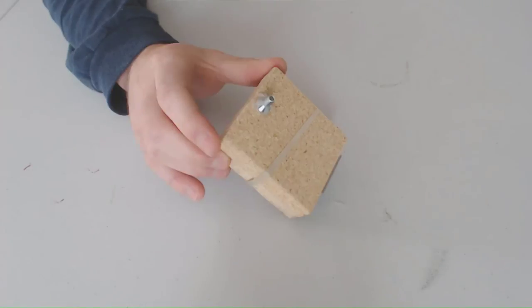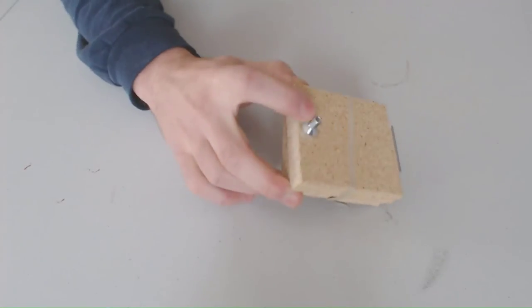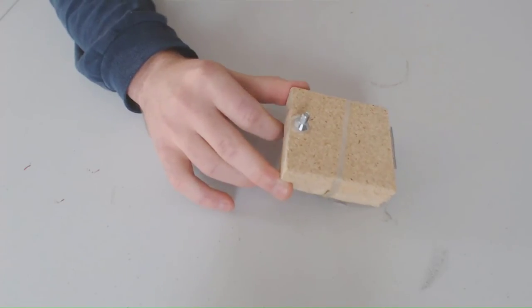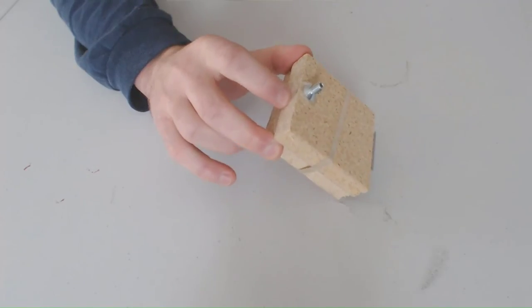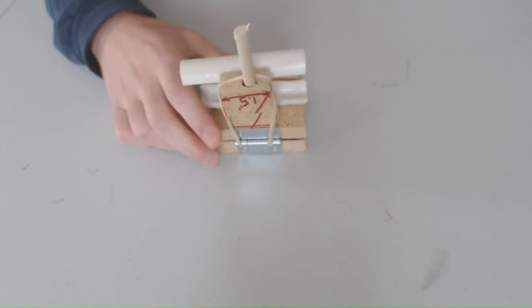The next thing that I want to talk about is the camera attachment. This makes use of 2 3-inch by 3-inch particle board pieces that are braced together by a hinge. Properly sized screws such as this one makes it possible to mount a camera. The screw is a 1/4-inch diameter, 20 thread per inch screw. This 20 thread per inch is a standard for camera thread attachments, and this allows it to be versatile for many different cameras. Finally, I want to talk about the phone attachment.